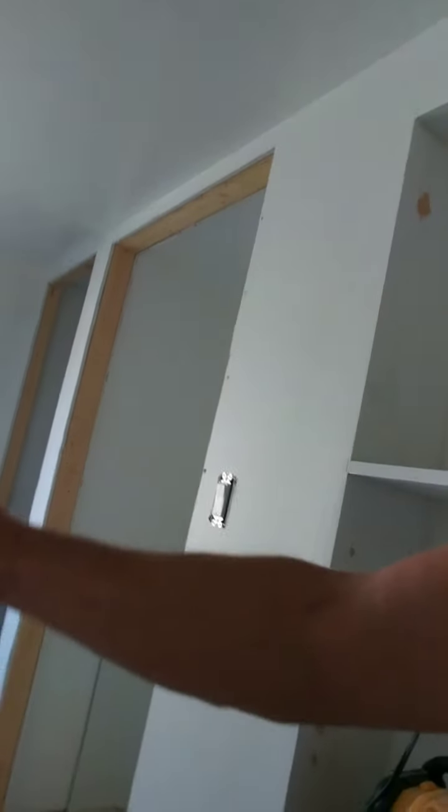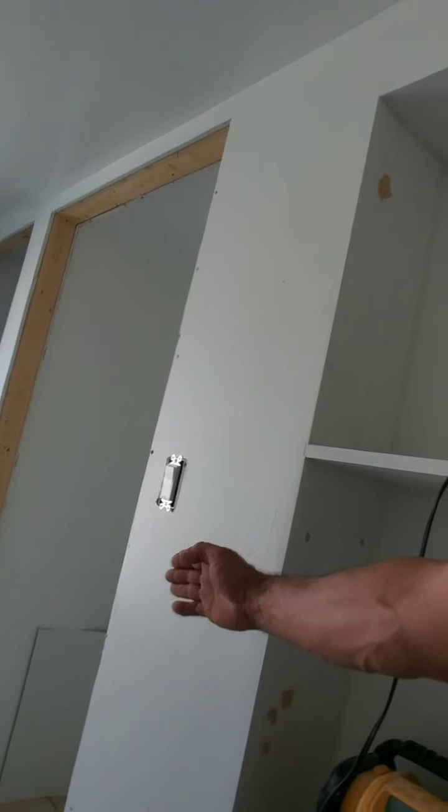So what are we doing in this episode? Interior doors — doors, doors, doors. The thing about interior doors is you want to think about which way the door is going to swing. Like here, walking into the bedroom, I want my door swinging this way — that's a right-hand swinging door. You can see it says that right on the label. You've got to make a plan of which way doors will swing and make sure you get all the appropriate doors for the openings and sizes: 36, 24, 30. Now we're back in the master bedroom — let's get busy and put in some doors.